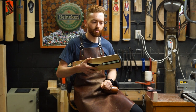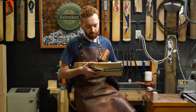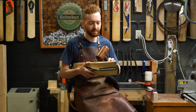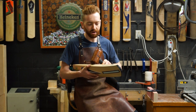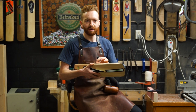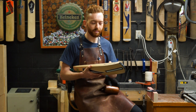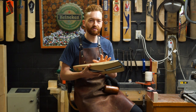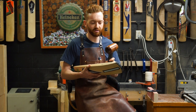You can see we're really starting off quite soft on the edge. We slowly want to roll them over a bit — you never want to go beyond too much of an angle, otherwise you'll start getting a lot of cracks. So we're rolling it over but rolling it off on that angle, slowly working our way up and down. The key thing is noticing where you're hitting it — it should be making some sort of impression. If it's not, you're probably not hitting it hard enough. Don't be afraid of seeing slight small surface cracks — if you do, just slow it down, bring that power back, and then slowly work your way up and down, slowly increasing the pace.